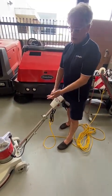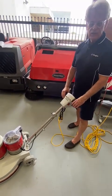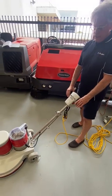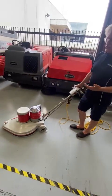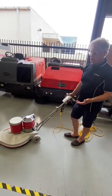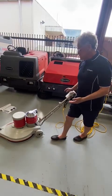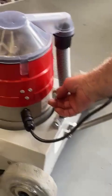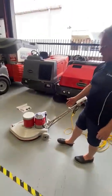If you do use it over a wet surface, you're going to suck up water. If you suck up water, that moisture can go right through the electrics into the vacuum and into the capacitors and damage the machine. If you have an overload situation — where you're using an extension lead that's not correct or the machine is too overloaded — it's possible that this little red button here, which is a reset button, could pop.